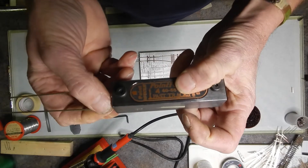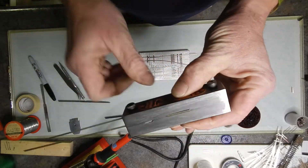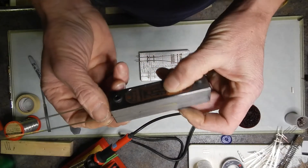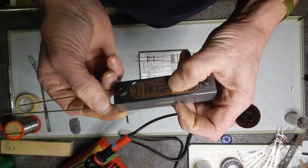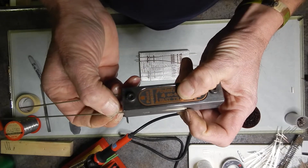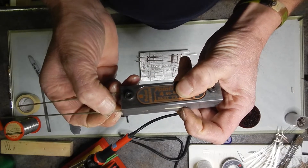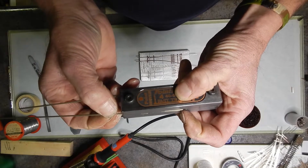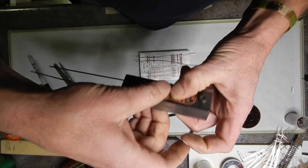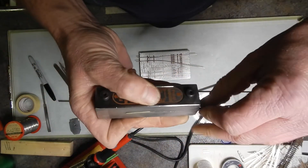What you're going to do is push down the base of this rail while squeezing the jig together. You don't really want to tighten it up because you need to be able to slide the rail in and out and adjust the rail. Get it so the head of the rail is just on the inside of the actual groove, so when you're looking at it nice and flat, that section of the rail is sitting there nice and even.